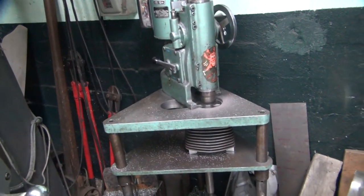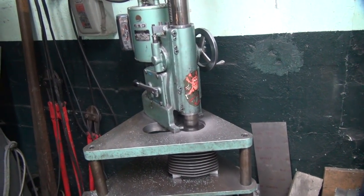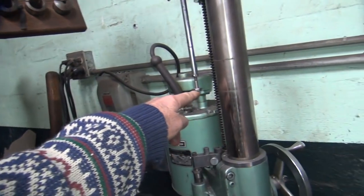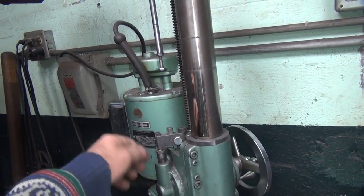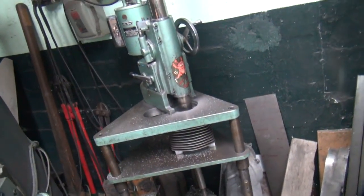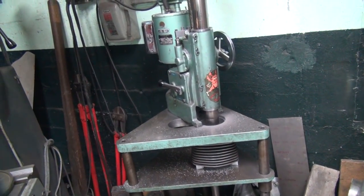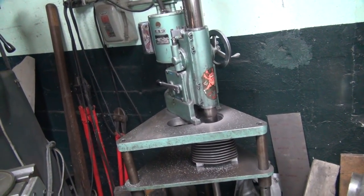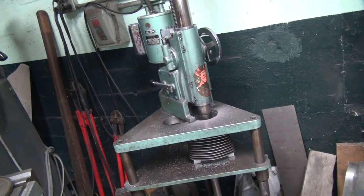Can't see much at this point. It's not always about what you can see - it's about what you can hear. This is an automatic stop - this is how far it's going to go. It pushes this button down, it'll stop, and it's down about here. So we've got about four to almost five inches more to go. I've got to do one more heavy pass on this cylinder, then come up and do a light pass, and then I can pull it out.